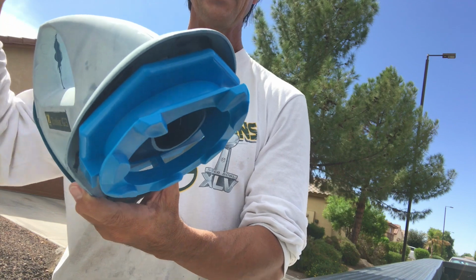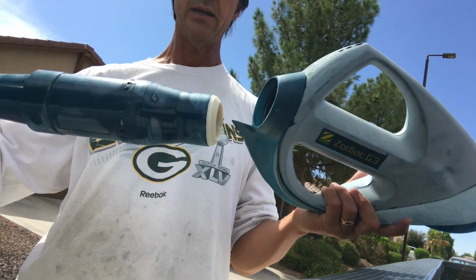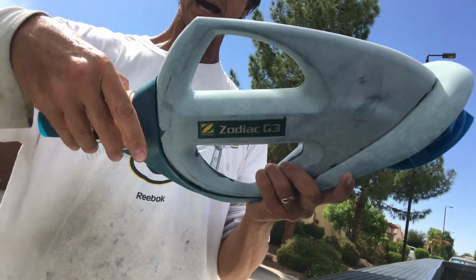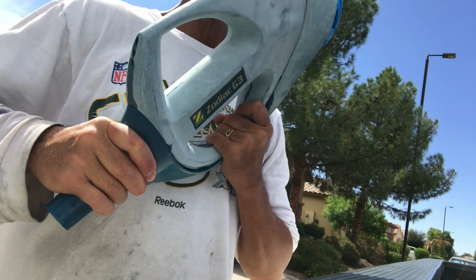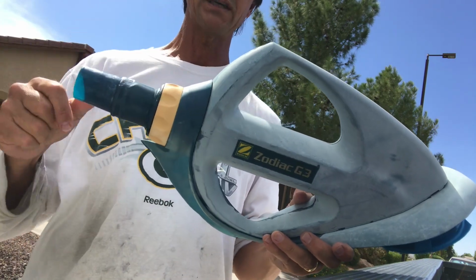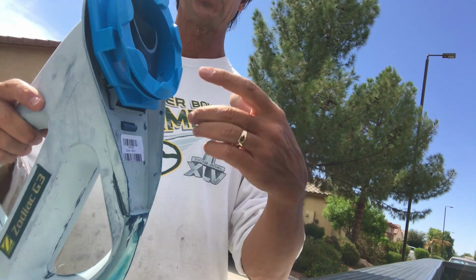Now from here, I'm gonna do something before I put the fin disc on. I'm gonna put this back on. I'm just gonna put the sleeve back into the top of the hole, and I'm gonna screw that big yellow nut back on. And I'm gonna screw it fairly snug. I mean, don't get channel locks or anything, but I wanna make sure that during the popping, because this uses a diaphragm and it pops around the pool, I wanna make sure it doesn't work itself free. Now, I can attach the last part, the suction disc.